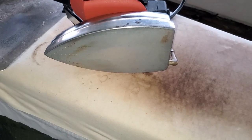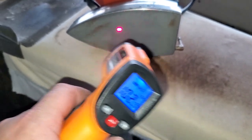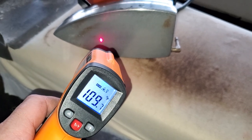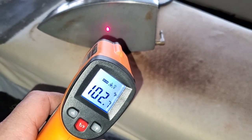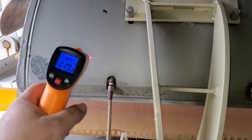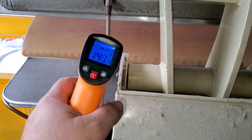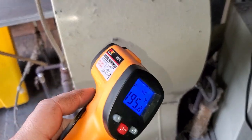When working with hand irons — industrial laundry equipment — you can do the same thing. If it stays around 100-something degrees on the high setting, there's a problem; it should reach around 180 to 200 degrees. If it doesn't get hotter, the thermostat or internal fuse could be going bad. The same concept applies to any press — it will show if there's a leak, if the press head has accurate temperature on all sides, and whether steam traps are clogged or not, helping with maintenance and catching problems early.